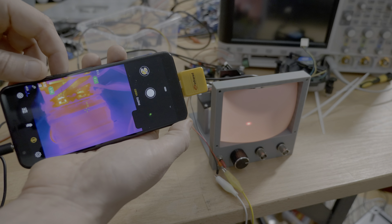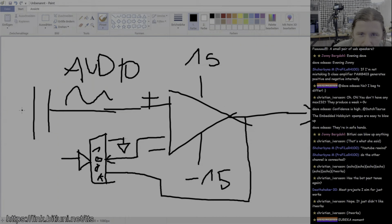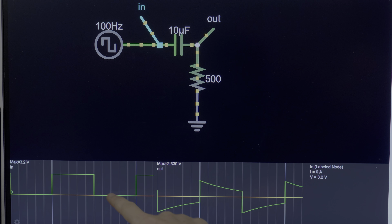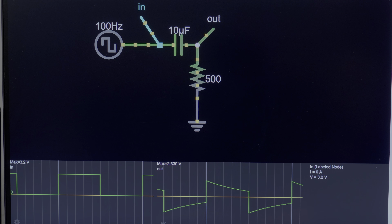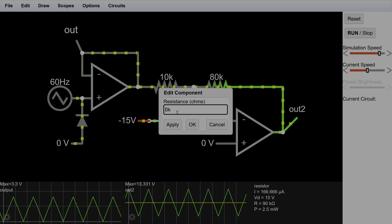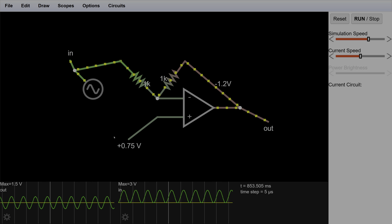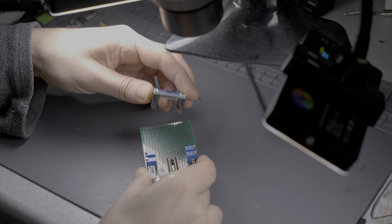OC music is nice but I wanted to drive it from an ESP32 directly. There was one issue though, that Sonic pointed out on the live stream: the digital-to-analog converters from the ESP are only outputting 0 to 3.3 volts. We could send it to an op amp with a DC blocking capacitor — this would clip the signal to plus minus 1.6 volts, but the big disadvantage is that you can't draw squares anymore since a constant offset will slowly be removed as the cap charges. Chat came up with some nice amplifier circuits working without this coupling cap, and I liked Roter Fruchtzwerg's cursed amp the most — it used the least parts so I was sold.